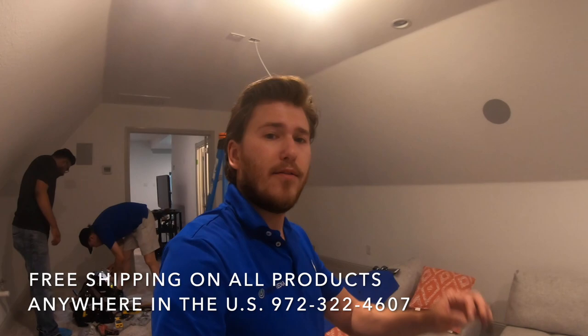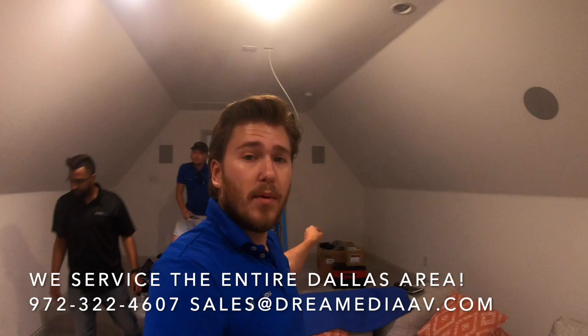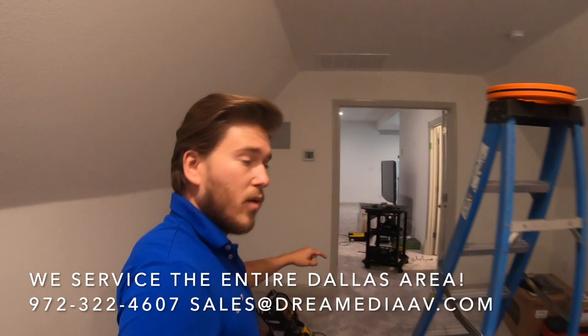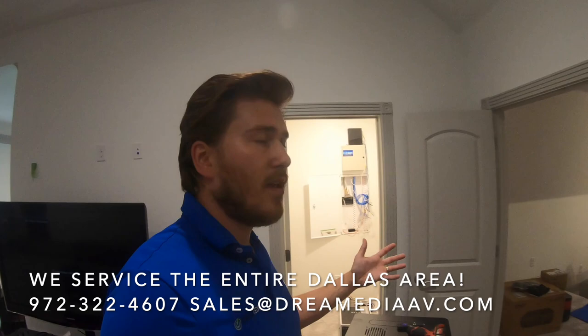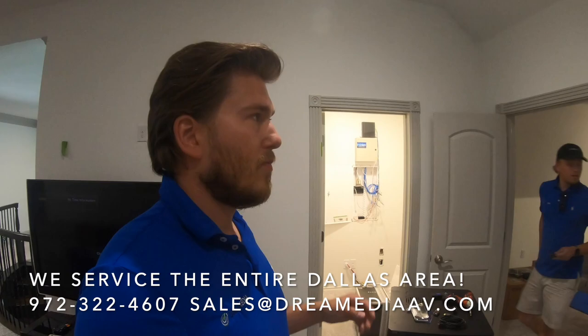So we're gonna just fish an HDMI cable through this tube back to our termination point, which is going to be in the closet over here. We're also gonna be using Cat 6, as Grayson just mentioned. And the reason is because we're gonna do a universal remote system. The IR is going to connect. Basically, the Cat cable is just to extend the IR for the Harmony system so that you don't have to use line of sight, because nobody wants to mess with that.